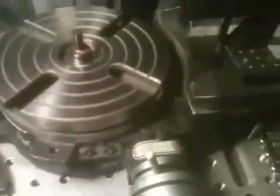Tighten up your clamps. I do mine in a sequence. I'll do like one in the back here, and then come over here and do this one, and then that one, and vice versa. Just keep staggering them around, so it's drawing down your table evenly.